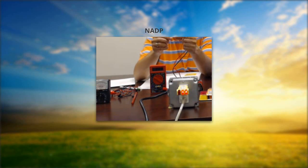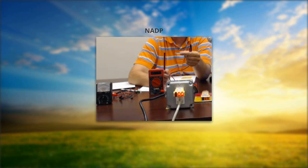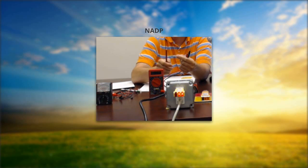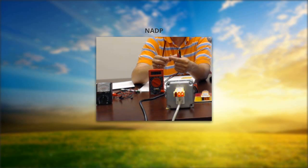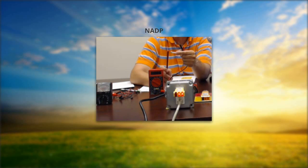That's why we always ask that when you go to the site, one of the tools you take is your multimeter or voltmeter. This is the cartridge-type fuse we use in our collector — it is glass with two metal ends. In very fine print, one end shows the voltage rating and the other shows the amperage rating. This fuse is rated 250 volts and 1 amp, but it's used even for low voltage. There's a fused wire in the middle — if you blow the fuse, this wire melts, but it can melt under the end cap so it will look perfectly fine but not actually work.